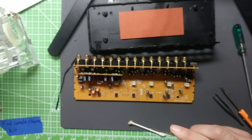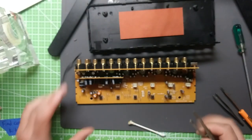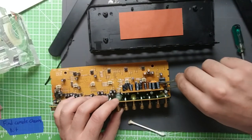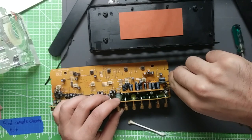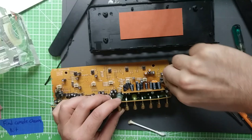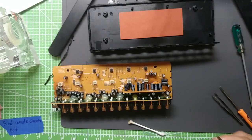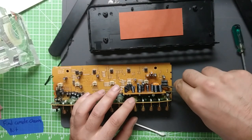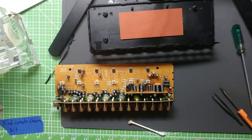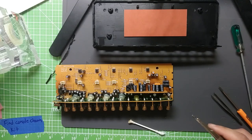Easy. Not always that easy. But the isopropyl alcohol does work wonders on the super glue or the hot glue. It's a little tougher to get at. And at the very least, outputs are over on that side anyways, so if it's other capacitors in that area, I'll want that board out of the way anyhow, so this will be worth it.